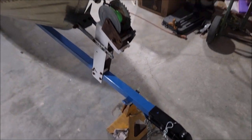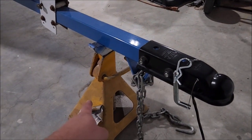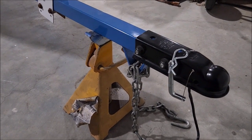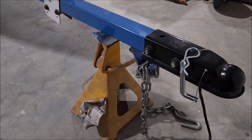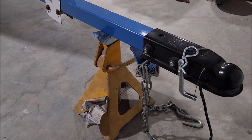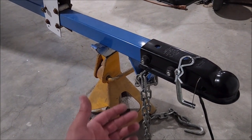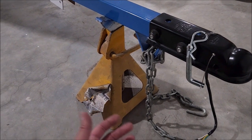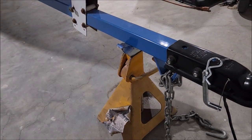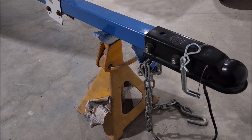I have this little vintage boat trailer here, it's 12 feet long and the trailer isn't much longer than the boat. The problem I'm having is I'm tired of carrying around a jack stand. I don't want a little trailer wheel because those little trailer jacks kind of suck — the wheel never really works, you wind up just kicking it in the direction you want and push and hope for the best. With a small trailer with a 30-pound tongue weight, you really don't need a trailer jack. What I was looking for was a little kickstand kind of thing that folds down and holds the trailer up for me. I looked around on the internet and found this one — it's a Reese Quick Stand.